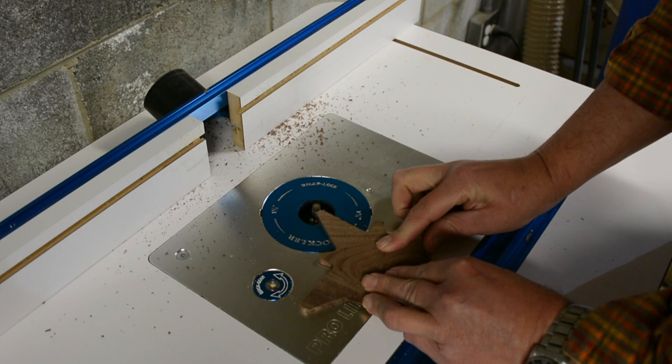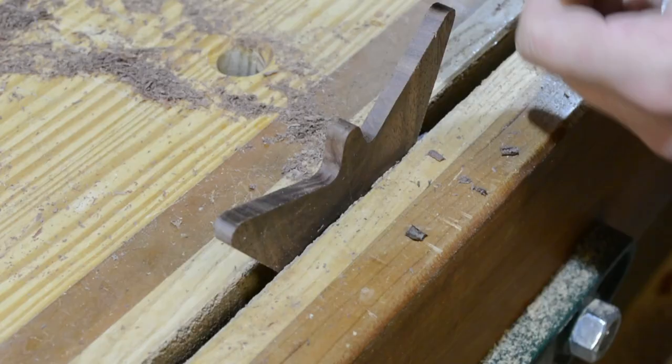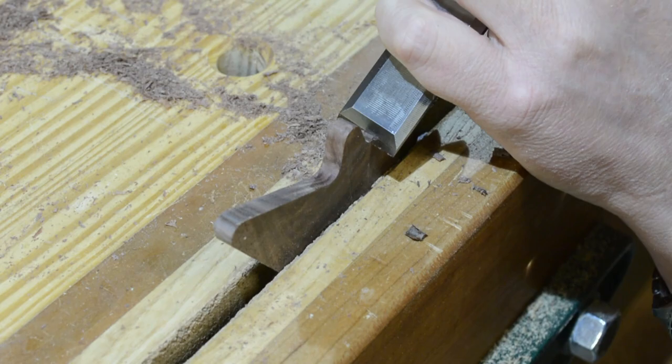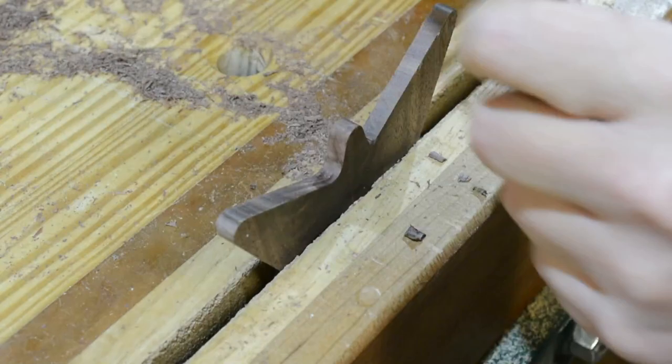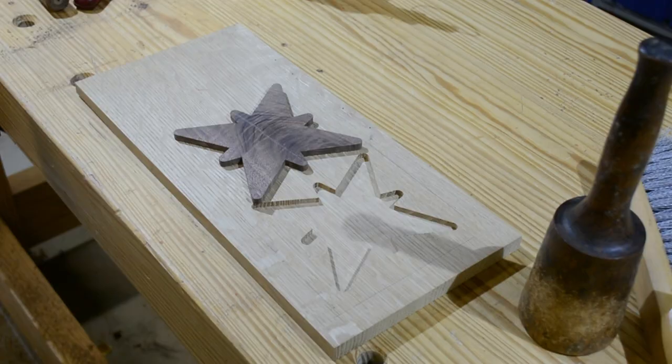With the bearing on the bottom, I've got the piece upside down and I'm just trimming it to fit. Those inside corners that I marked, I've got to cut them out by hand. Use a good sharp chisel — there's lots of flat area to lay the chisel against. A good lesson: don't be afraid to make patterns or pieces that can't be fully routed, simply because you can work with hand tools.